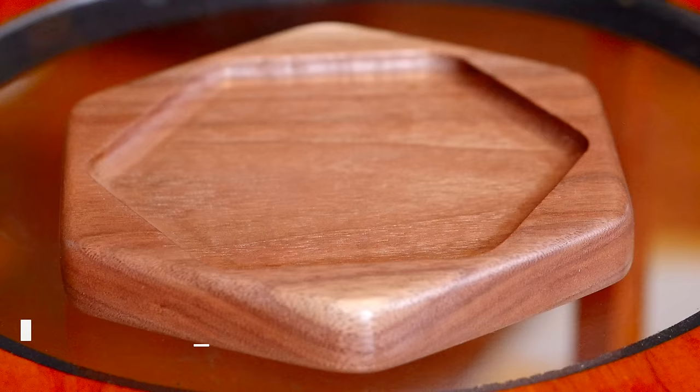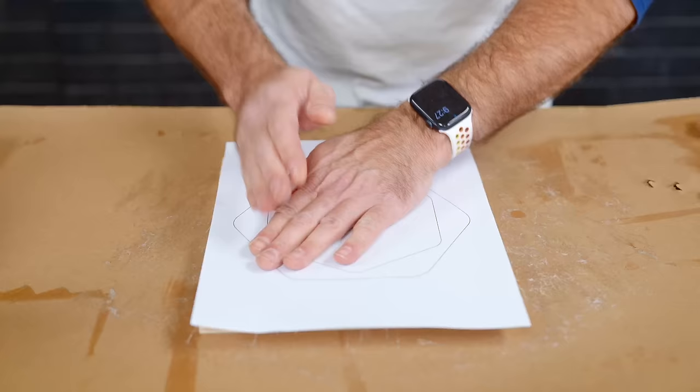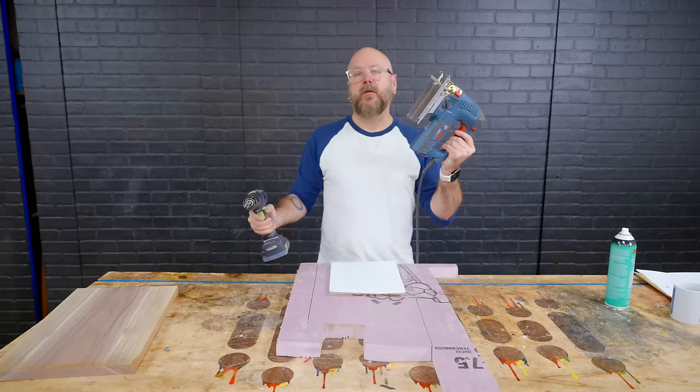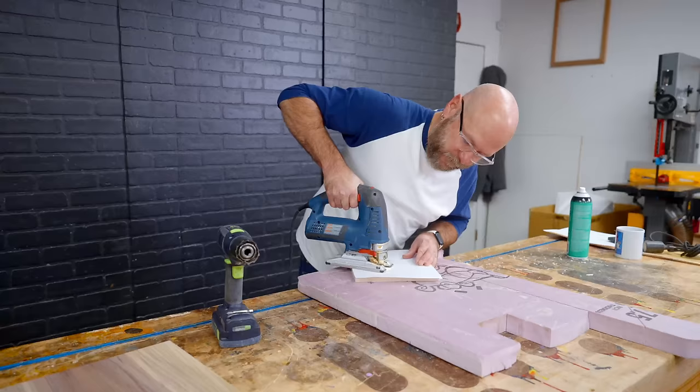We're starting off with a very basic valet tray, a place to throw your keys as you come in through the door. I got my template printed out, so I got some spray adhesive. I'm going to mount it right onto some plywood. We're going to use a jigsaw to cut out the inside of the template, but I need to drill a hole first so we can get our blade in there. One of my favorite tricks with the jigsaw is to lay some foam insulation on top of your bench and use that as the sacrificial bottom.